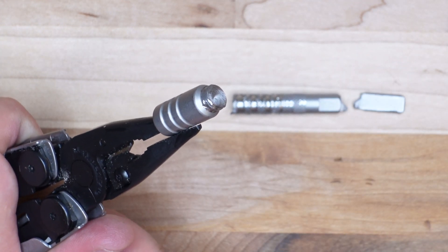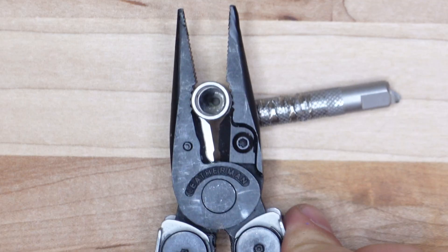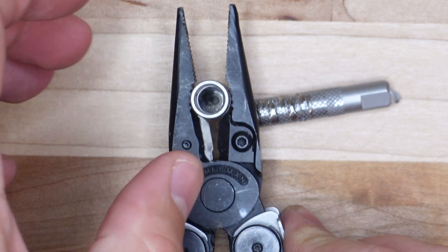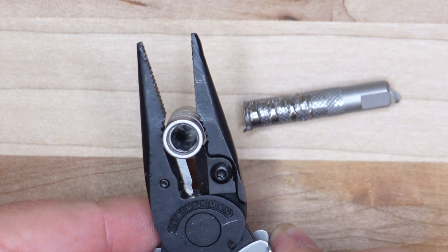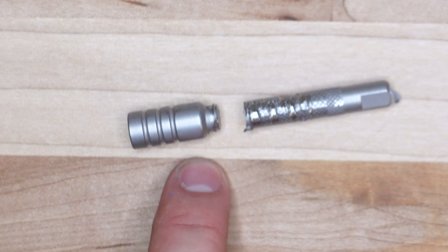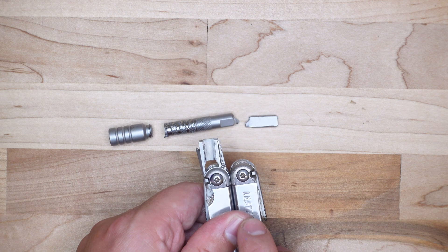So I think it's safe to say we just exceeded the metal strength itself — it had nothing to do with the design. We're just putting a ton of force into a quarter-inch diameter shaft, so that's how it broke. When I took the cup off and took a look inside, it's really still in pretty good shape — there's a little bit of damage in there, but not bad. I just don't have a good way to test how much torque that cup itself can take, because as soon as I put this in the bench vise and squeeze it down, it's going to crush the cup. So now you know: about 60 foot-pounds to break the cup off the shaft, about 21 foot-pounds or 250 inch-pounds to break the Leatherman tab off the shaft, and about 220 inch-pounds to break the Leatherman bit adapter itself.